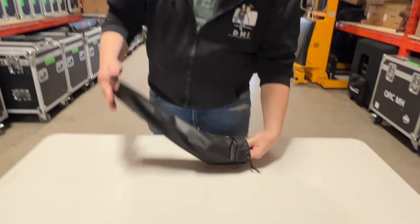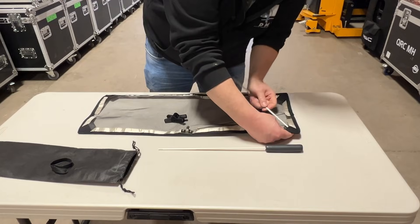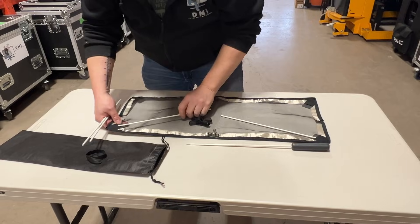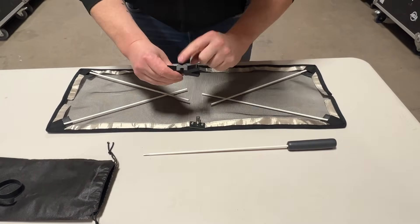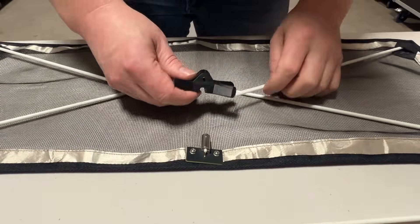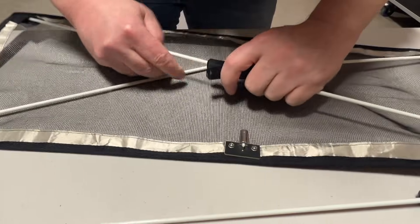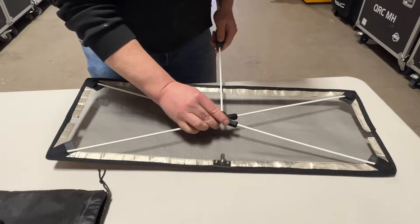Putting it together is pretty straightforward. You start by sliding the four fiberglass rods into the sewn pockets on the antenna. Once that is done, take each of the rods and place it into the 3D printed hub — this needs to be pointing towards the BNC. When you get to the last one, you'll need to bend it slightly to tension everything. It'll flex and then snap right into place. Heads up: don't put the fiberglass into the 3D printed piece first and then into the fabric, because the 3D print is more likely to break in that circumstance.